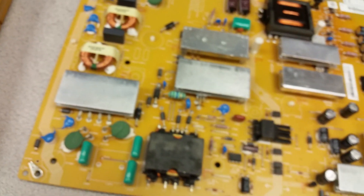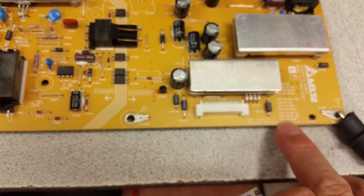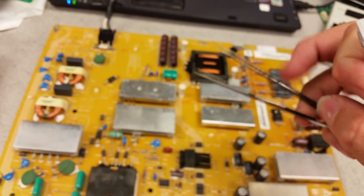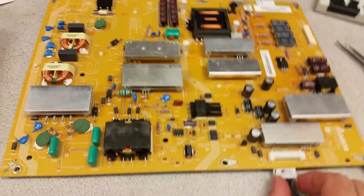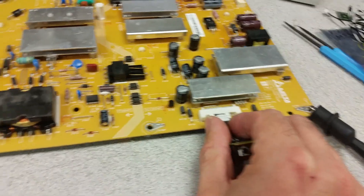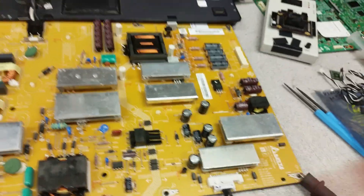Basically what happens here is you take the output from pin 15 and short it to pin 14. One way to do that is with a regular wire, another way is with tweezers, but if you are going to be testing and doing it multiple times, the really reliable way is to just hack a simple connector that takes care of that.